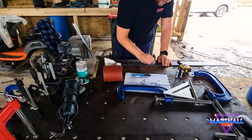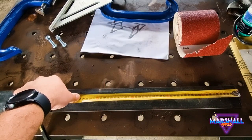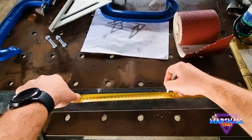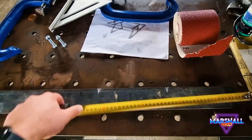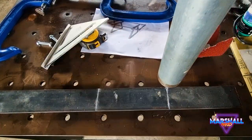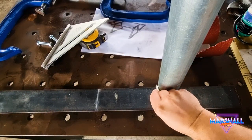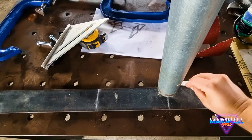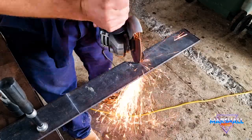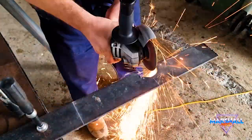So here's what I'm working with. I've got my 65 by 5 mil plate and I'm marking up 400 mil — that is my overall length. Then I'm gonna mark a centre mark at 200 mil. Then I'm gonna put the bar where the tow ball is gonna be, right on that centre mark, and mark around it. This is gonna give it a lot more strength being inset or cut into that flat bar rather than just floating on the end. As I didn't have a hole saw with me, I used a cut-off wheel and a grinder to cut that piece out. Would have been a lot quicker with a hole saw, probably a bit tidier, but I'm covering it with weld anyway.